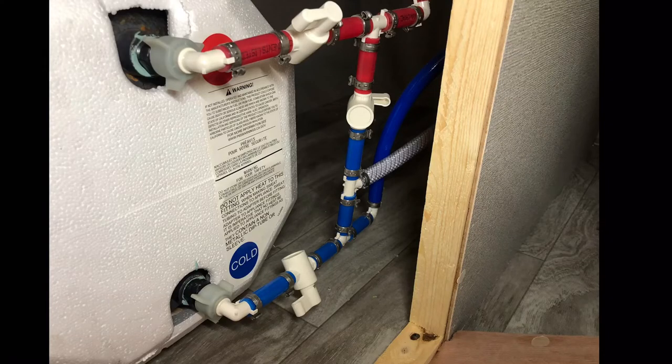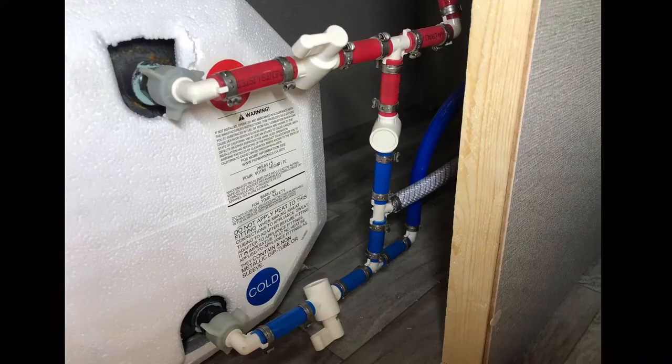In this video we're going to discuss a three valve bypass for your water heater. The most common thing I see when people complain they're getting lukewarm water is they haven't turned the bypass correctly. In this picture here you can see that the middle valve is still open.